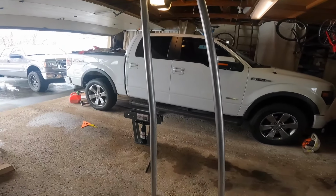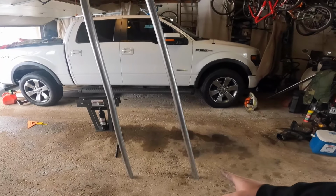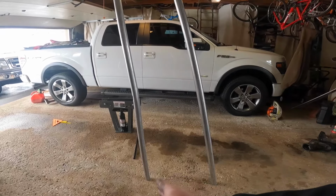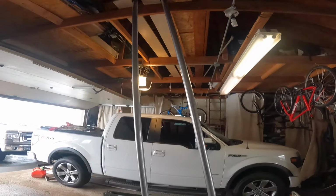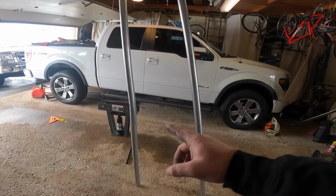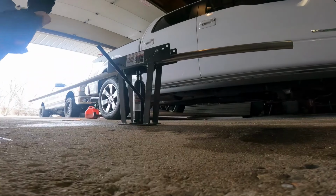Okay, so I think this is the best way I can show you guys. This pipe, if I hold the camera level, sitting back at 10 degrees, this pipe comes up straight and bends back, and it looks like that was accurate, that this is about 5 degrees. So I'm gonna put this back in the bender, I'm gonna bend it probably another 10 pumps, and we'll see if we can get these to even out.